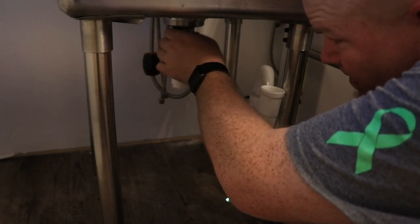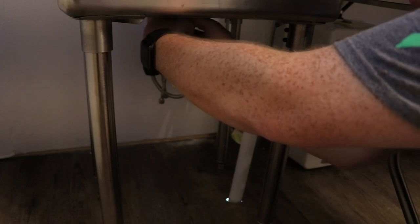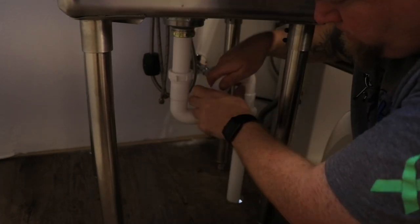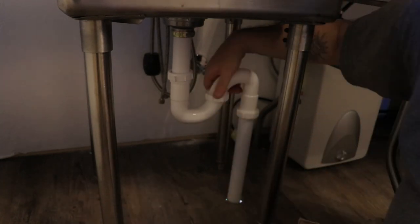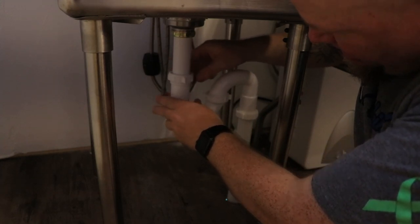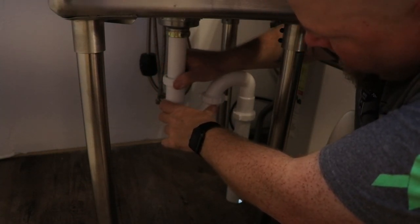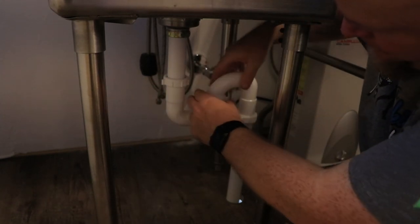I go back in and reattach it to the sink, then just fine-tune the tightness on the actual drain itself on the sink because I noticed it was a little loose. Good and snug. I ended up taking it off and putting it back together, and now everything's connected — just tightening down all the rings. This plumbing is so easy, guys — it's just basically snap-together plumbing. Most of your plumbing these days is just this plastic twist-together stuff and anybody can do it; it's real easy. These little gaskets seal up against the pipe so there's no leaks on the inside.